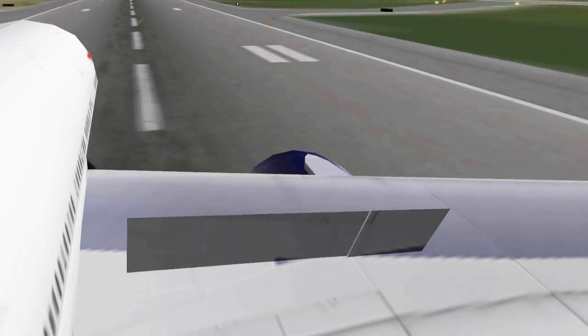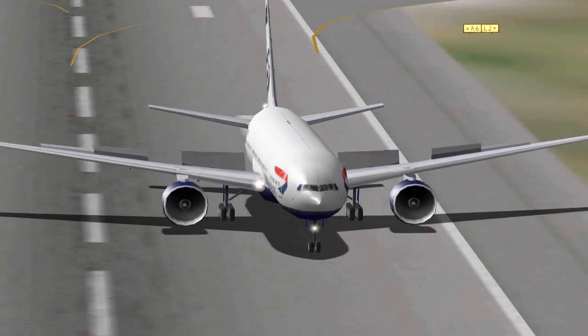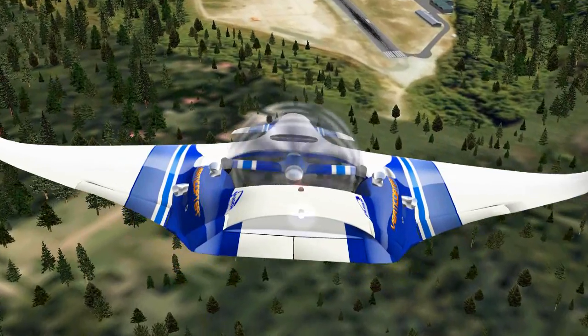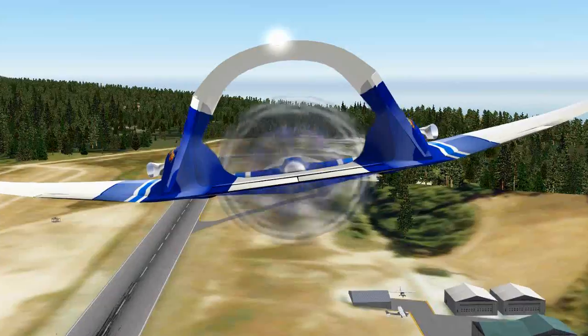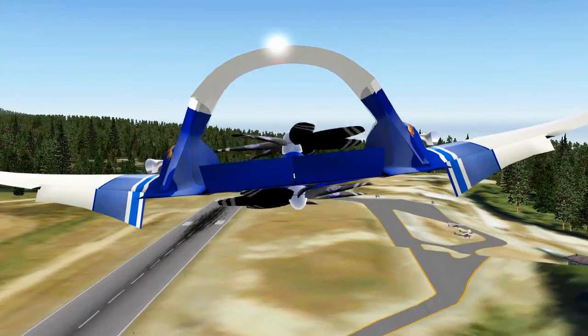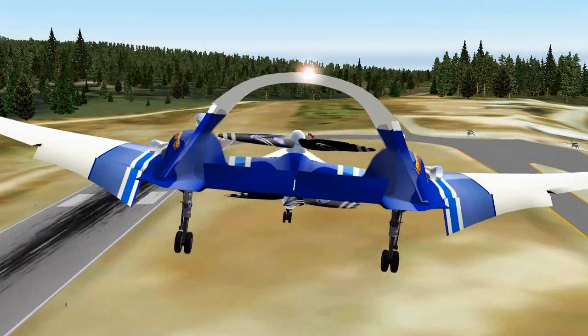Normally, an airplane's speed brakes deploy as spoilers on the top of the wings, also helping press down the plane's wheels during landing, increasing the traction needed for braking. But for the Verticopter, a plane that normally does not require a landing strip, it was more important to maintain a neutral pitch moment during the deployment of the speed brakes. Another important consideration for this design was also trying to avoid added weight and complexity.